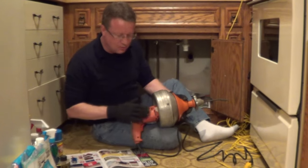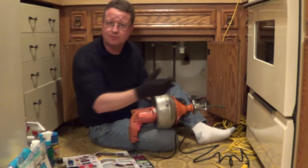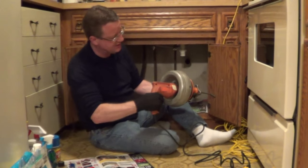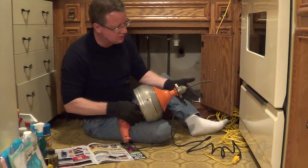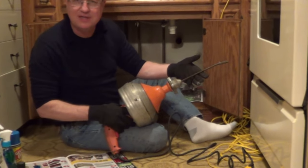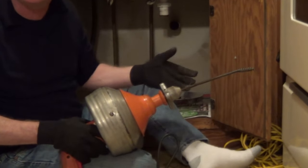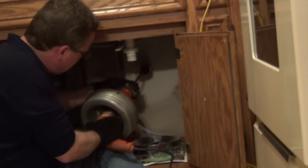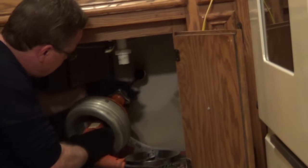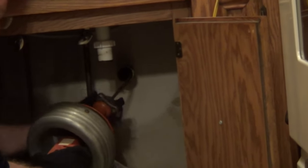Now we'll go after it with the router. You're going to want the drill in a forward motion — keep it forward whether you're pushing it in or pulling it out. As you're looking at the drum, it should be turning in a clockwise direction. So we're just going to loosen the chuck and then start feeding the rod into the main pipe, feeding it until it stops — either hitting a clog or hitting a bend in the pipe. Just line it up and start feeding until it stops, then tighten up the chuck.